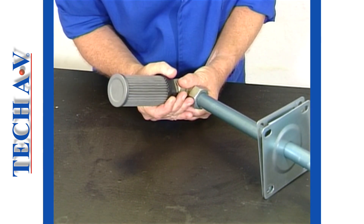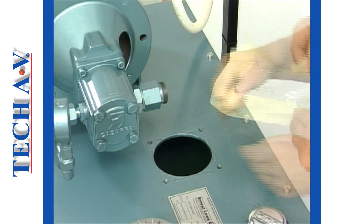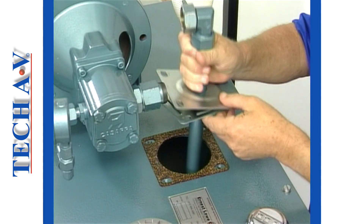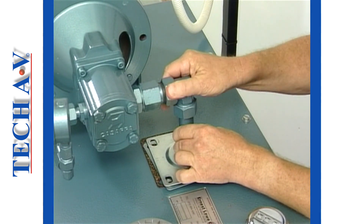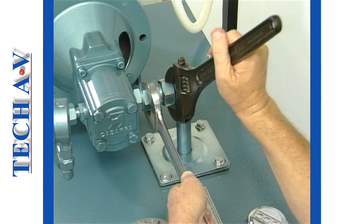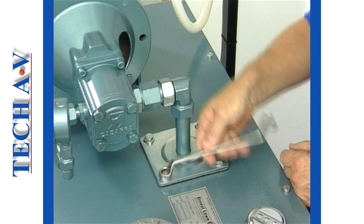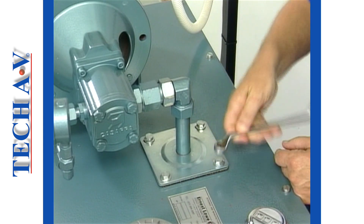The complete assembly is ready to be reinstalled into the tank. Remove the protective cover, position the gasket, and then carefully reinstall the suction line. In order to maintain proper alignment of parts, the suction line connector should be first threaded by hand onto the pump inlet. Next, the adapter plate fixing screws are loosely threaded into their locations. Then, using two spanners as demonstrated, the pipe connection to the pump is secured firmly. The plate screws can next be tightened progressively to prevent the plate from buckling, thereby lessening the chance of a leak.